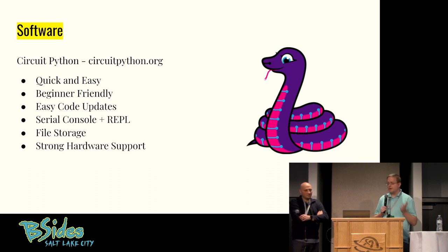I have never done microcontroller programming before this year — really it's been more like six or seven months. We first started out with MicroPython on the previous badge we were working on. For this one we decided to go with CircuitPython. It's very easy to use — these bullet points were taken from CircuitPython's webpage. The thing I find very nice about it is that if you take your badge and plug it into a computer, it will show up as a file system. You can just go in there and modify the code directly. The board will automatically reboot with fresh code that you just installed. It's very friendly for new people like me.